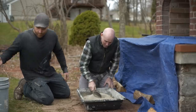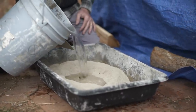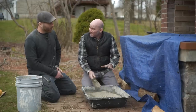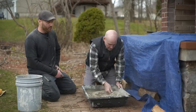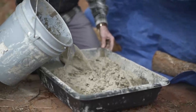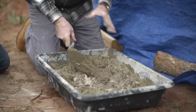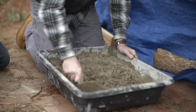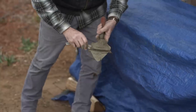Why don't you get me some water — pour it right into that center, just a little at a time. We're going to want to add the water slowly because we can't take it out. I'll know when I'm done when I get an oatmealish consistency. That's going to give me some workability and let us push the mortar deeply into the joints. People tend to overpour the water because it's easier to mix — they don't really know they're doing it, but they're not feeling so much resistance. You've got to fight that. I've got that oatmealish consistency that I like.